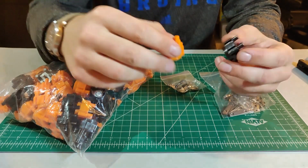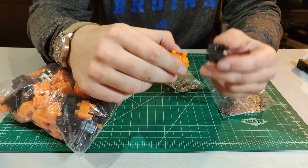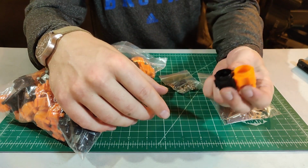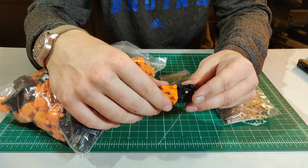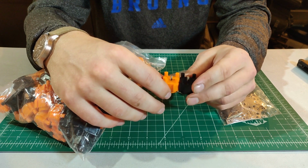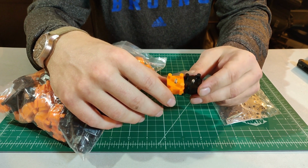So the main attraction is these molded caps that go on the top and bottom of each battery. Now, what these do is they link together. So these bus bars go in between the screw terminals, connecting each end of the battery cells together. So you can wire these in series or in parallel, as many as you like in either direction, to get the capacity or the voltage you want for your final battery pack.